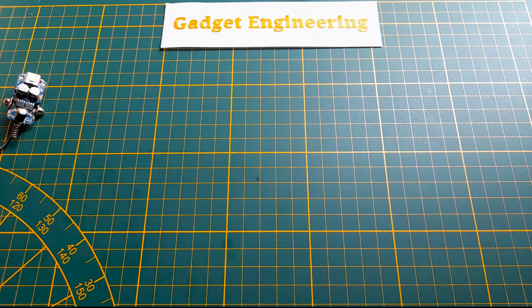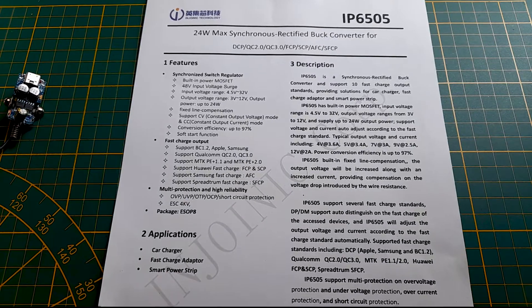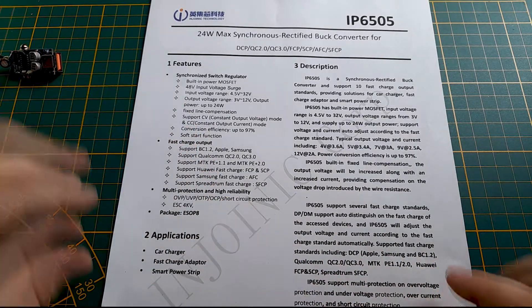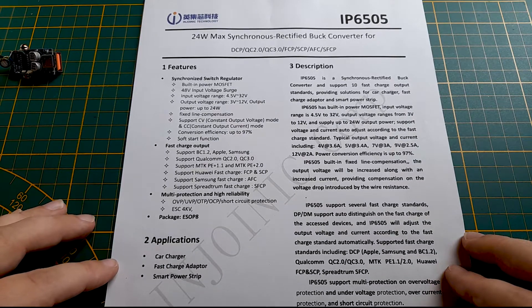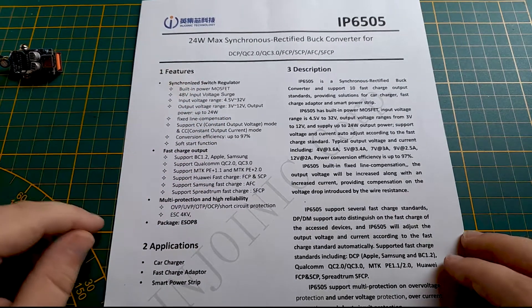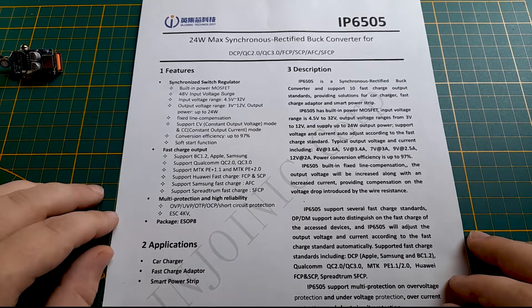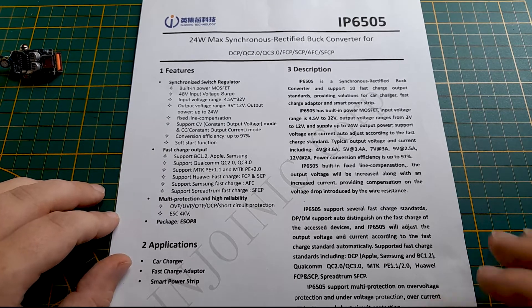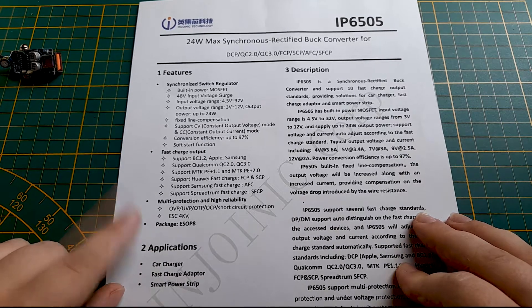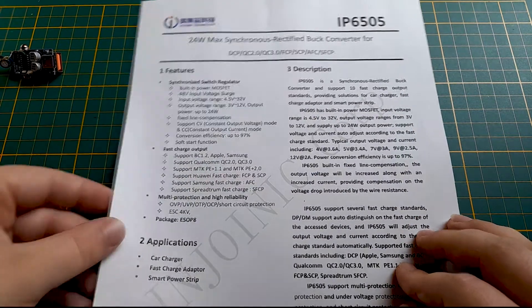The other chip, the IP6505T, is also a very modern, dense, powerful chip. This handles the USB-A output — essentially a quick charge output — doing the other buck converting through the other 150 micro-Henry inductor. This one has up to 32 volts of input, so even though the device says 24 volts maximum for a truck system, you could probably bring it up to 32 volts; the other datasheet is rated maximum 36 volts, so 32 should be the top. It supports Quick Charge 2 and 3, Huawei, Samsung — but no Power Delivery on the USB-A port. It claims up to 24 watts max.